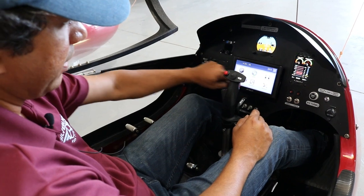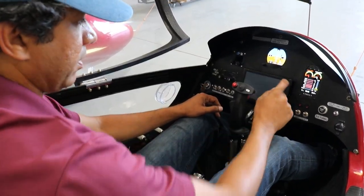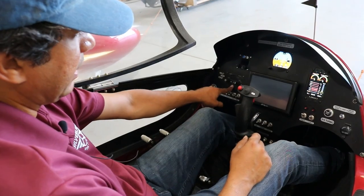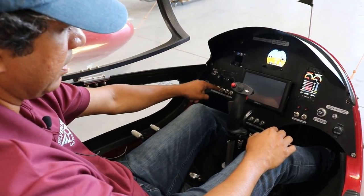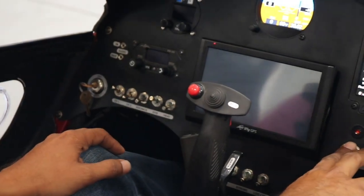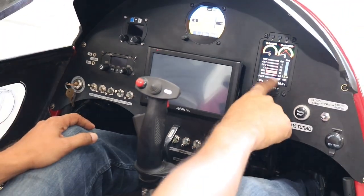You can shut the LCD. This is the iFly GPS — we do that as a standard option, but I'm just going to turn it off because we don't need it right now. I'm going to take the avionics, which is transponder, intercom and radio, as well as ADSB — that's all on the avionics submaster, and we're going to keep that off. Lane A and lane B are turned on, but they're not getting any power right now. That's why all these axes.